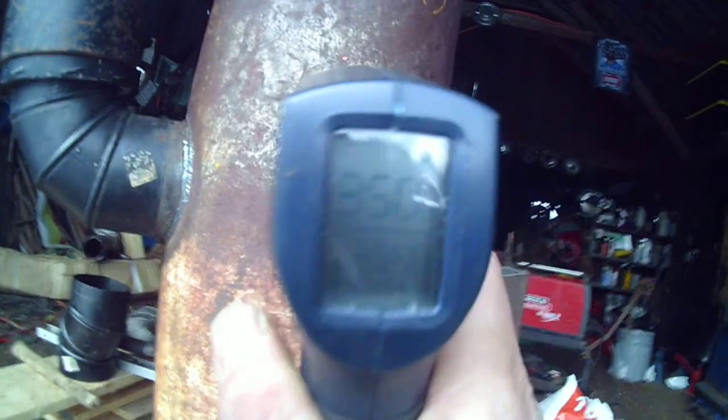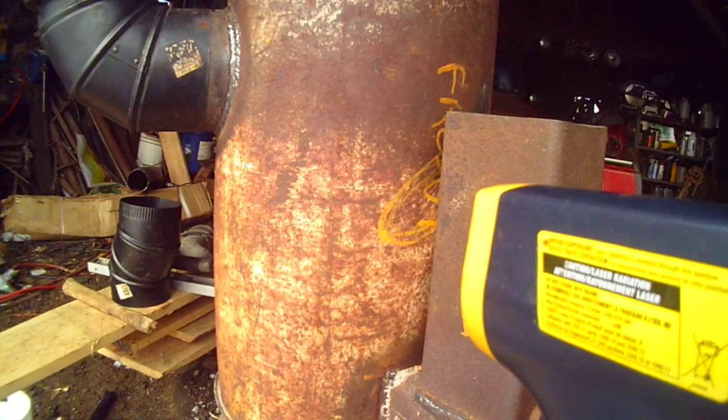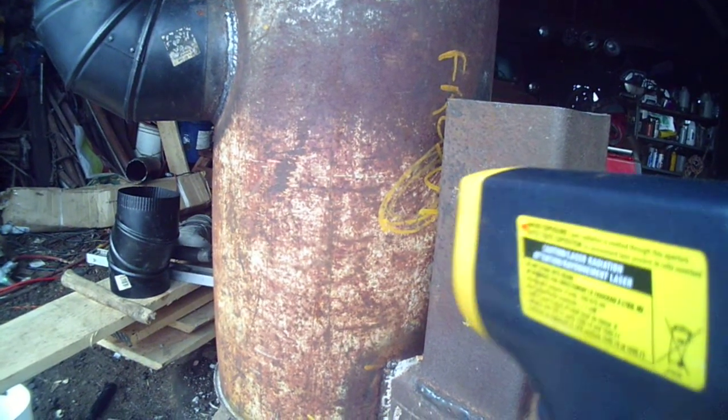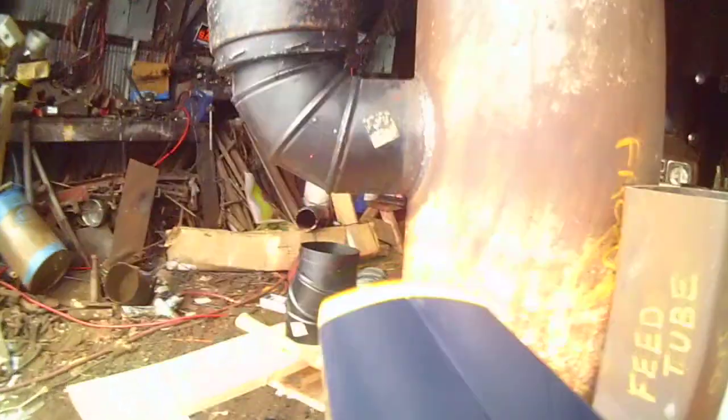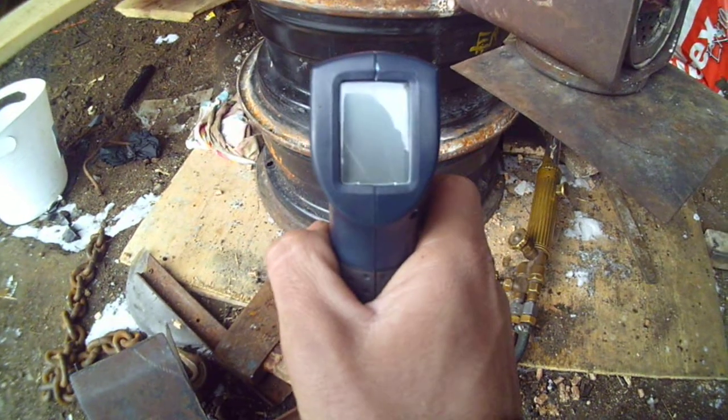350 on the heat exchanger midway — I call that midway. Now you're going to see a huge difference where my concrete mixed mass is. Up at the midway we got 350, then where the color changes — where the white paint is not burnt off yet — 150 to 170. If I move up to the bottom of the exhaust we get 200 degrees, and 200 degrees on the elbow, maybe a little better, 210.